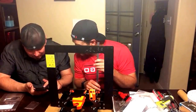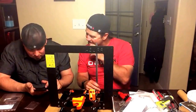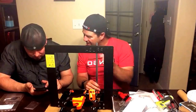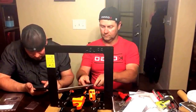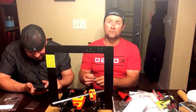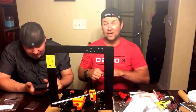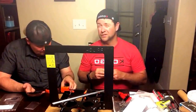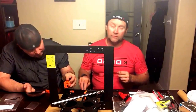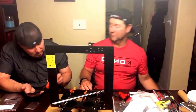In case you manage to push a ball out from the bearing, please count them. 1, 2 is okay. We only lost one. If there are more, please consider ordering new bearings. So if only 1 or 2 balls come out of your bearings like we had, you're okay. I think we'll probably replace it anyway because this is going to be used for extremely high tolerance work. But you should be okay. They are just cheap Chinese bearings.